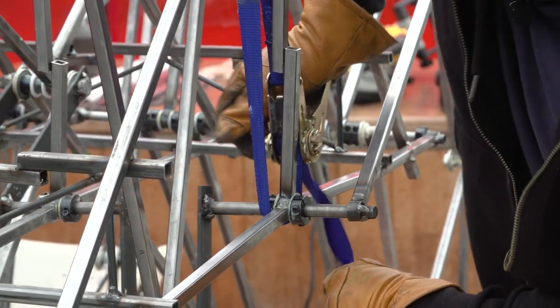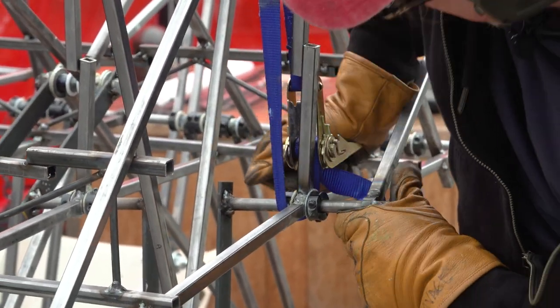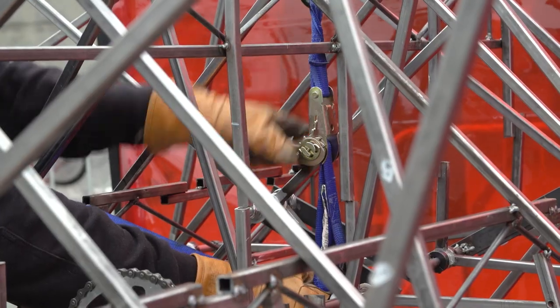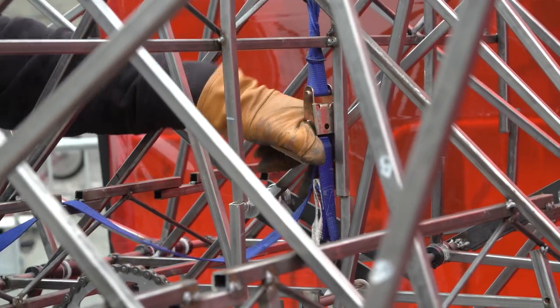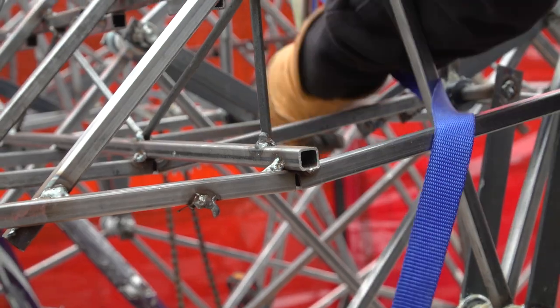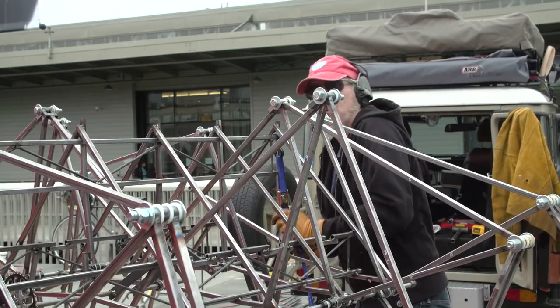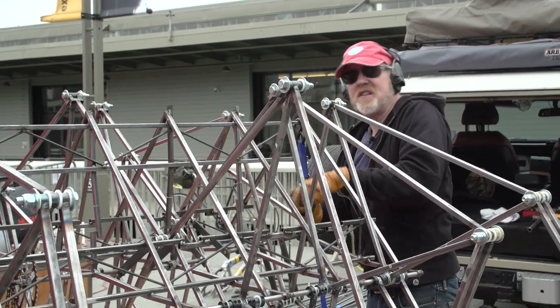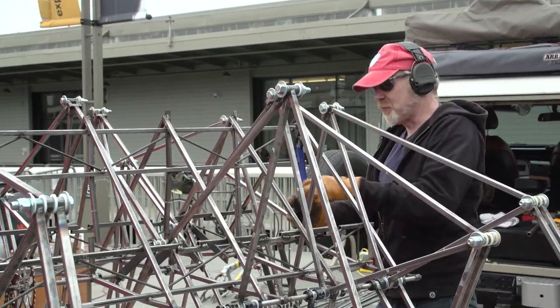In order to change the Strandbeest geometry, I need to bump up these center pivots by about 3.5 inches across the whole thing. I can't do that all at once because it's already built. So I've made some weakening cuts and I'm slowly persuading it with the ratchet strap, just one by one, working my way through it. I'm about halfway there after 45 minutes or so. I'm feeling pretty positive. It's just gonna take a bunch more grinding like this.